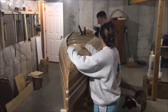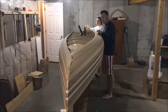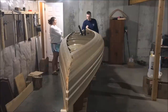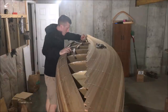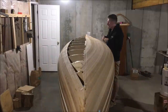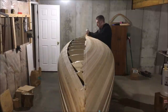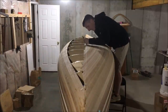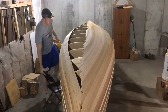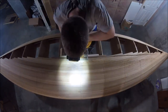As you start closing the hull of your canoe, I found it to be a lot more difficult, so it's really nice to have an extra set of hands. Luckily, my wife is a champ and offered to come help me despite the fact that she was about eight and a half months pregnant. I kept on planking until I was well past the center line. I used paracord and two brad nails to mark a straight line from stem to stem, then used a straight edge and pencil to turn that string line into an actual pencil line. I was going to use a circular saw to cut straight down the middle of the canoe. It's pretty nerve-racking, but it's the fastest way to do it, and Adam from A Guy Doing Stuff did it, so it was good enough for me.